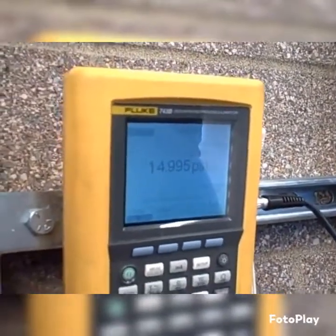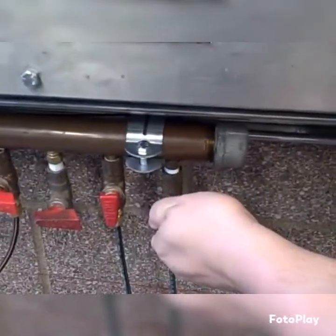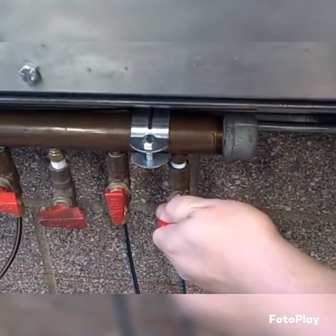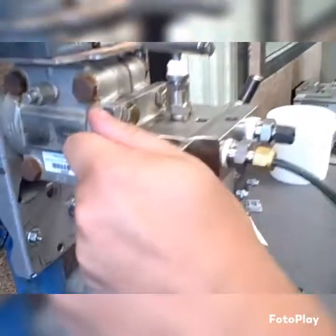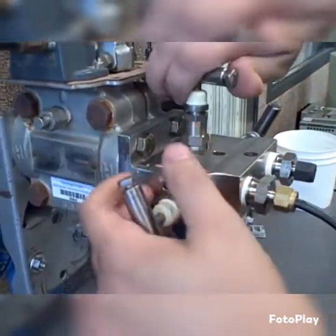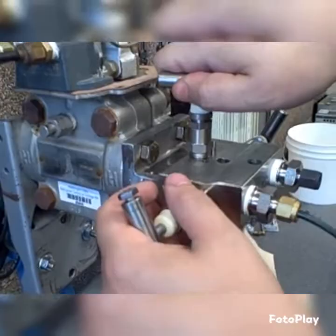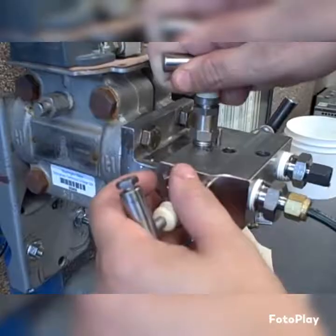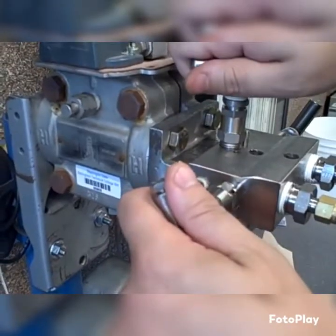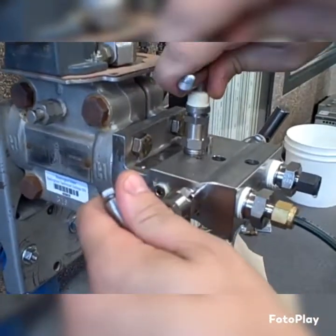Let's check on zero, because you know you're going to have to adjust the zero anyway. We're shutting off the air supply here. Air supply for our test pressure regulator. Because it has a three-valve manifold on it, it makes it very convenient. You can open up the equalizing valve and close the block valve, and that will bleed off the pressure applied to the transmitter.